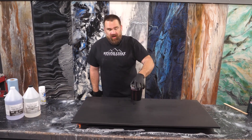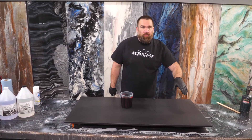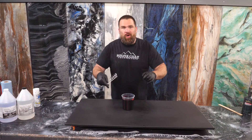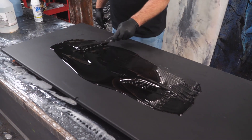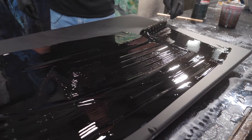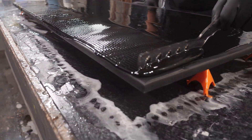We're ready to pour this out onto our project. I'm gonna pour my epoxy in the center of the project, keeping it away from the edges. Once you give the epoxy a way over, it's gonna want to keep going there. Trowel the epoxy all over the field or the surface of your project, giving yourself a little perimeter to keep it from going over the edges. Once the field is covered, we're gonna take the trowel and let that epoxy go over, have a nice even coating, and then we're dragging in our veins.